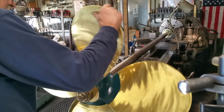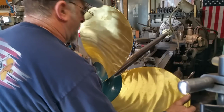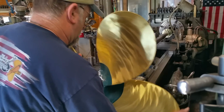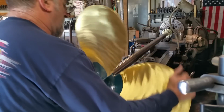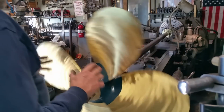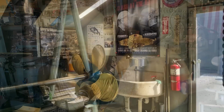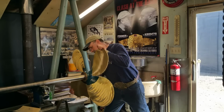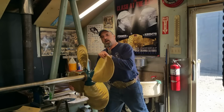Okay, that way, it doesn't come off here when we energize it in the lathe there. You work it, rotate it, pull back so that the lapping compound has a chance to breathe, spread, change locations. Doesn't take long when you first start for it to get dry and time to pull it back off of there, wet it up, put it back on. Alright, this is going to take a while.